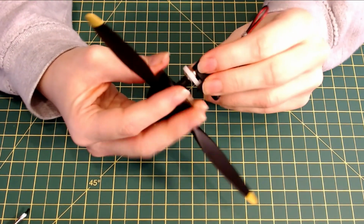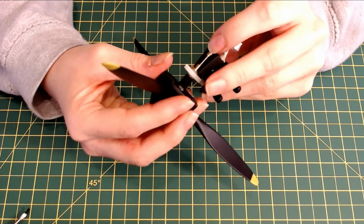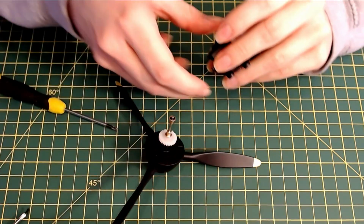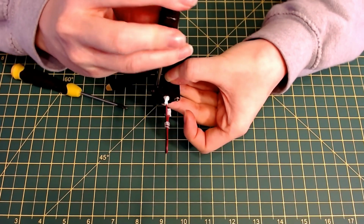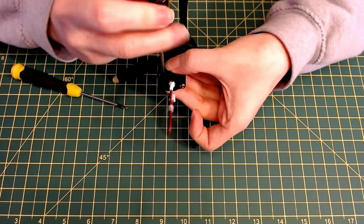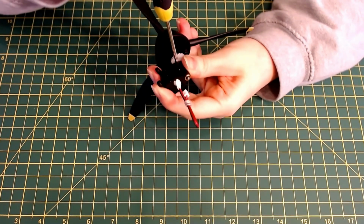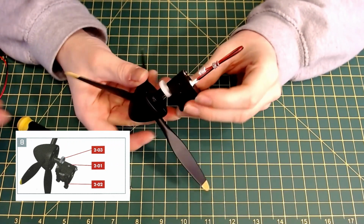As I say, it's difficult. It's more awkward than anything else, but make sure you get those brass parts of the motor housing, like your brass bushes that are going to rotate obviously. Once you've got it all held down, you're going to put in the two PB screws and tighten them up so it holds it in place, and then we have the finished item. So just tightening up those screws, making sure that it's going to hold that motor and everything in place.